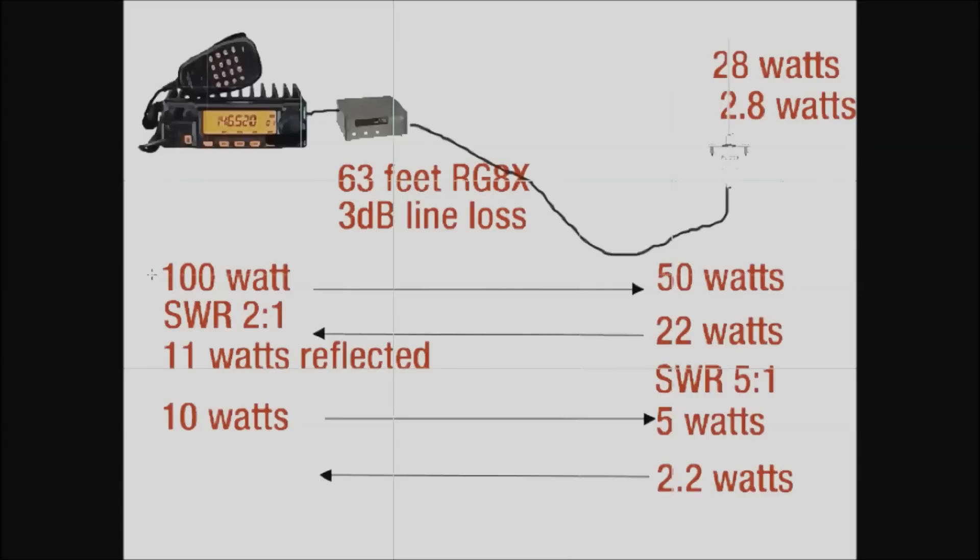With 31 watts radiated out of 100 watts, we're losing roughly 5 dB — or about 1 S-unit — in the coax. So we have 1 S-unit of loss in this system, which originally looked really good: it had a 2-to-1 SWR and 11 watts reflected. But the truth of the matter is, it's not very good. We're losing 5 dB in the system that's needlessly being lost. The reason for that is the 5-to-1 SWR at the antenna and the RG-8X, which is very lossy at 146 MHz. That was interesting, and as promised, the outcome was a 5-to-1 SWR — much higher than you might suspect if you were the operator and saw 2-to-1 with 11 watts reflected. It looked really good; in actuality, it wasn't.